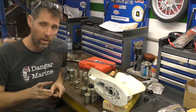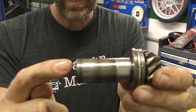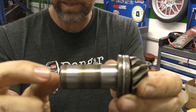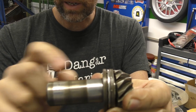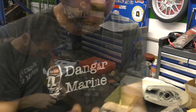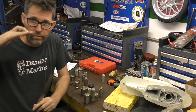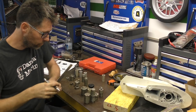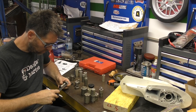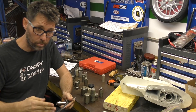Alright, we'll take that pinion gear out now and figure out how far down we need to push each of the bearings. So what I now know is we need 126 millimetres from the reference point back. We need the top of the top bearing to be 126mm plus the distance of the dark section — that's 6mm — so I'm going to say 132 millimetres from the top of the gearbox housing to the top of the top bearing. And the bottom bearing needs to be 126mm plus the distance from the reference to the start of the light section here, which looks like 36 millimetres. So I'm going to call it 162 millimetres from the top of the gearbox to the top of the bottom bearing.